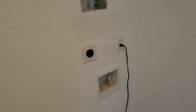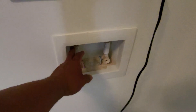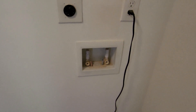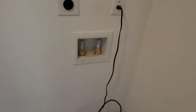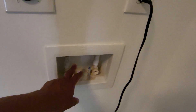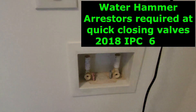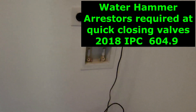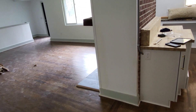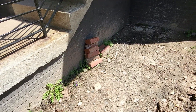Let's talk about the laundry area. I typically check to make sure water hammer arrestors are present — remember, any quick-closing valve requires a water hammer arrestor: dishwasher supply lines, washing machine supply lines, and most ice maker supply lines. Here you have hot and cold water lines and the water hammer arrestors are present. Some laundry rooms have a floor drain, but this renovated home does not.